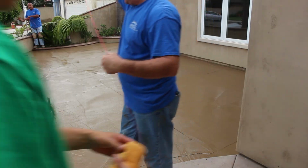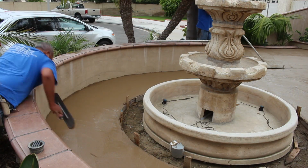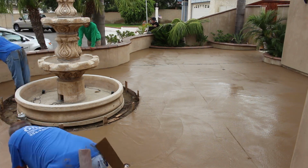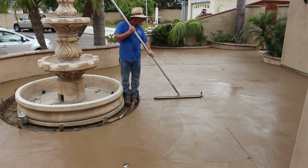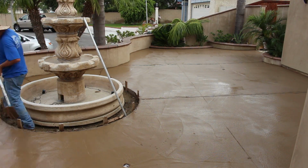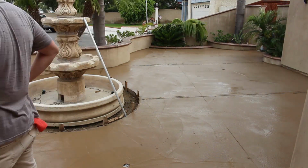We've got a dry line snapped into the wet concrete, and that gives us a guide to run our cutter blade, which goes 2.5 inches deep. Then we'll follow that up with a 3/4 deep, 1/2 inch radius for a final tune-up. But basically, once you hit the concrete with a 2.5 inch cutter and you've broken all that aggregate apart that deep, it's going to crack there whether you can see the joint or not. Because if you push cream back in there, the aggregate's still broken, and it's still going to crack in a straight line, although it'll be more visible, of course.